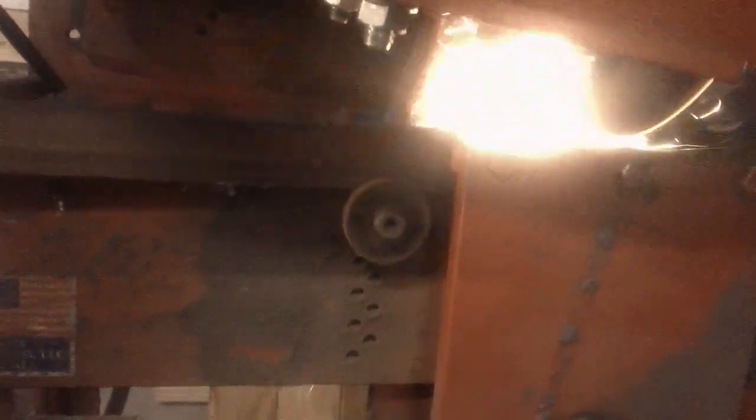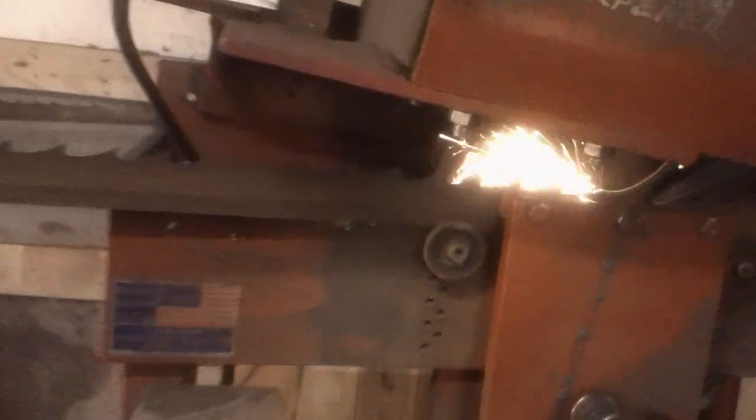As you can see, I'm making sure I'm getting the face top angle and also getting a good cut. What I usually do is touch the top of the teeth — if they feel like a needle, they're sharp. You can also look at the faces, check the faces, make sure you've got a good point on them and you're getting a good grind on them.